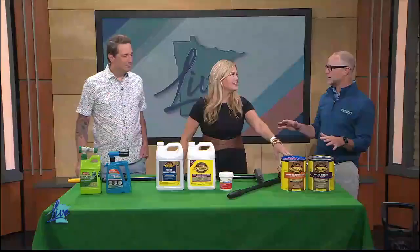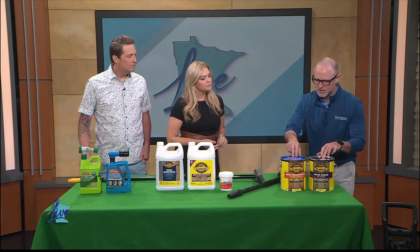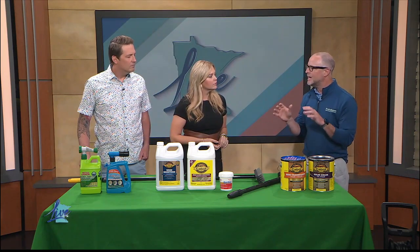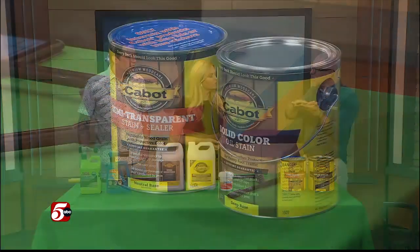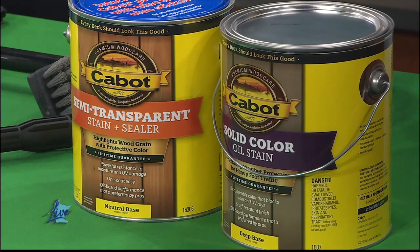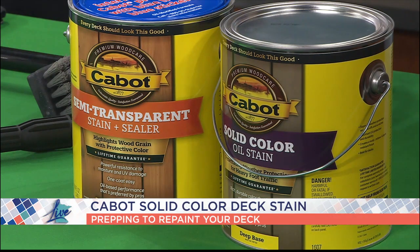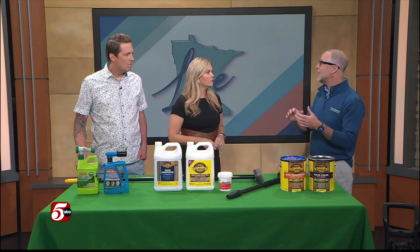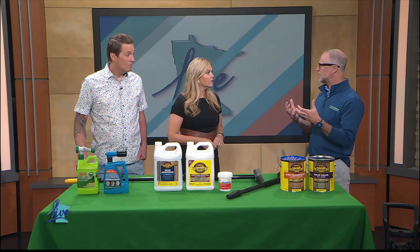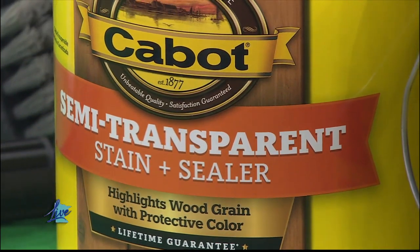When you're all done, you want to seal your wood. If you have a wood deck, you want to seal and protect it. I brought in two different things here. One is a solid-tone deck stain, and one is a semi-transparent. People make this mistake all the time — they put down and paint their deck with a solid-tone wood stain, which is a layer of paint on top of the deck. A semi-transparent works into the deck, so you can still see the grains of the wood. In Minnesota we put down a solid-tone deck stain, and then snow lays on it for six months, and then water, and it starts to peel it up. Really pay attention to whether it says solid-tone or semi-transparent on your deck stain.